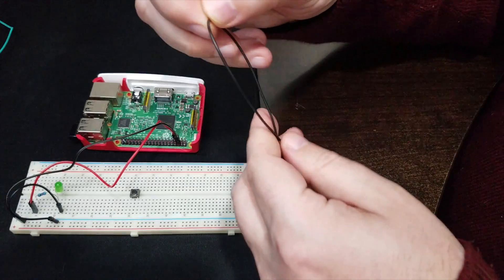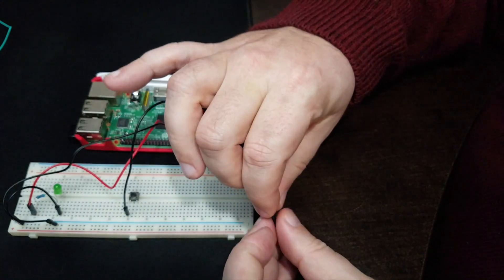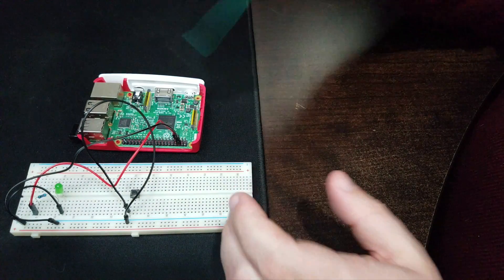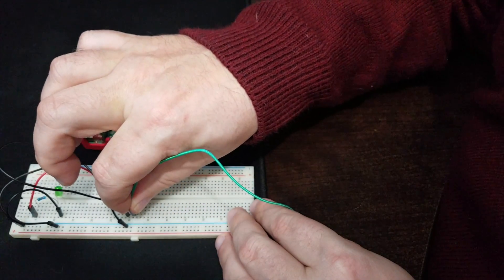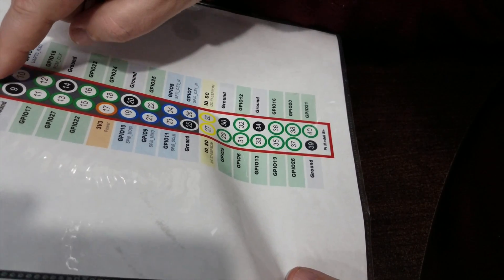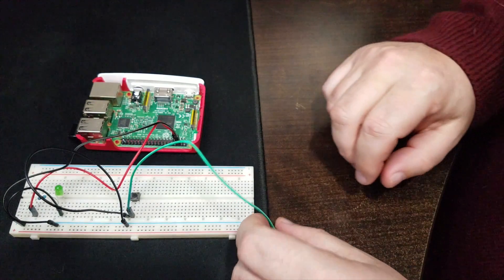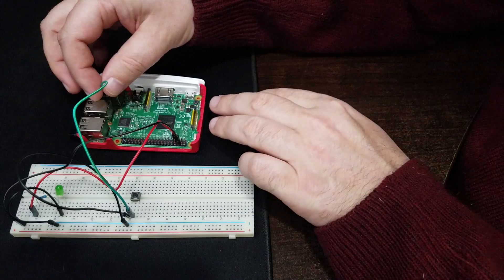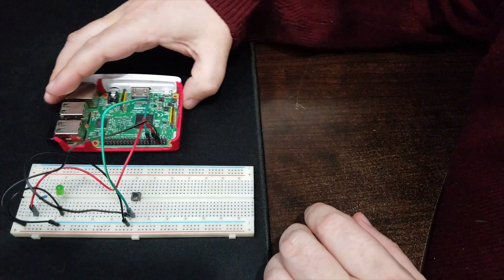I'll take my next male-to-male cable and on row 30, the top pin, I'm going to make that the ground. Then I need a GPIO port for the bottom pin. I'll grab the GPIO pin printout — I tend to use the back row first. I'm already using number seven so I'll use GPIO 17 next, which is pin 11 — the sixth row, two less than the other GPIO pin I'm using.